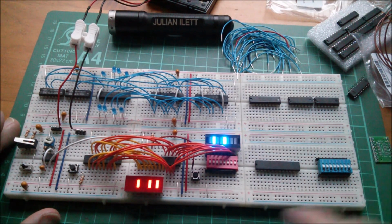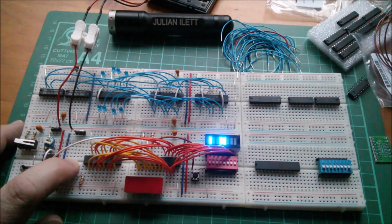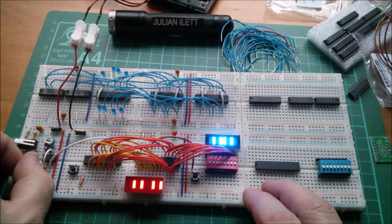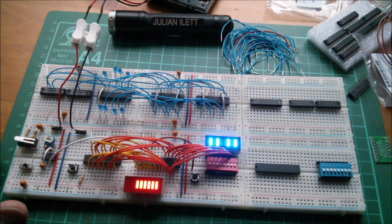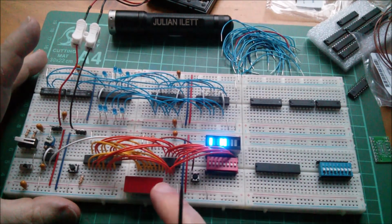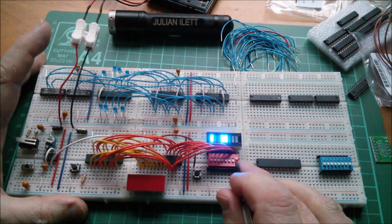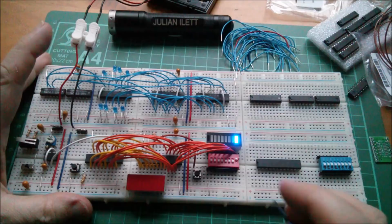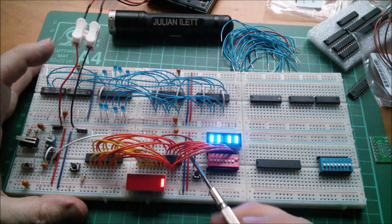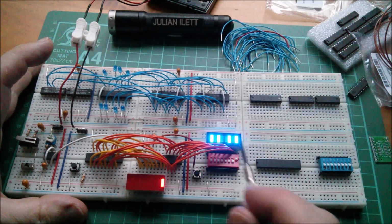Yeah, that's doing something. What I want to do now is program, let's reset it to 0. So it is following a sequence. Let's put it into single step and just program a few instructions to make sure it's doing what it's meant to. So that puts it to address 0, in which I will write, oh yeah, I've changed this switch and this one's not loosened up yet. I'll write a 1. When I clock that, the 1 goes into there, because the data coming out of the RAM, which is on orange, goes to the switch so that I can write to it.